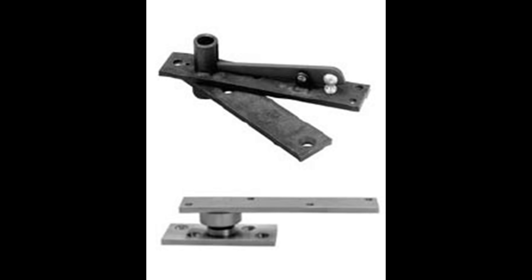That's easy. Of course it is, because you want to make these closet doors disappear. My question is basically the depth — perpendicular to that face — are we going to run into a problem where that mortise is going to exist closer than 5/8 from the finished wall? It's got nothing to do with the dimension from the face of the wall, because you're going to mortise that into the center of the thickness of the door. And the door is going to be flush, and you're going to have 5/8 of rock on the elevation of the wall. Where you're going to mortise the top pivot will be behind that 5/8, but what I'm referring to is the underside of the header — what you would see if you stood in the opening and looked straight up. The underside of the header.